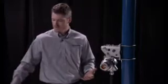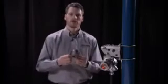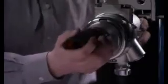Again, at this point, it would be normal to still have a fault indication on the receiver because we've not aligned the transmitter to the receiver yet. But before we leave, I'm going to take my weather shield brow and install that over the face of the receiver. Now we'll go complete the same process at the transmitter, and when we come back we'll expect that our yellow LED has turned green and the device is operating properly.